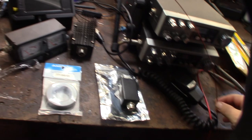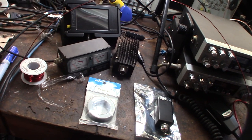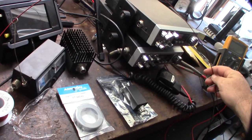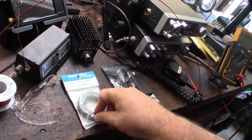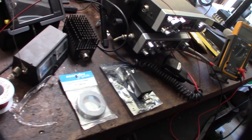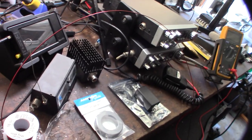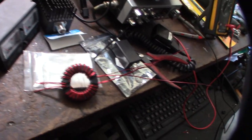I've got to wrap this toroid. I would have preferred to use silver wire — most videos and documentation I've seen use 18-gauge silver-plated wire. I'm going to wrap with magnet wire covered in enamel, being careful around the edges. It's 12 turns — like a half turn, 11 turns, another half turn. I haven't wound a toroid in many, many years, so we'll see how it goes.